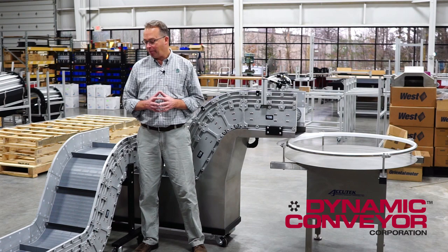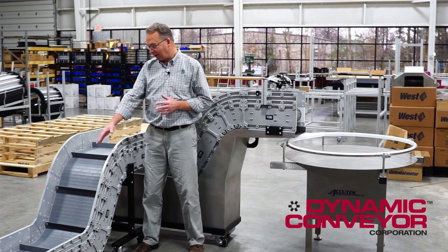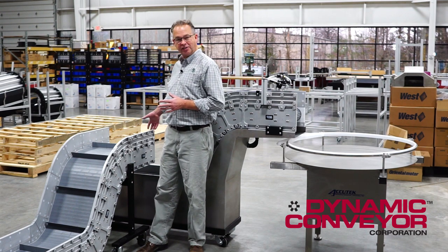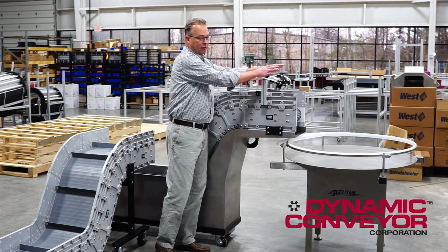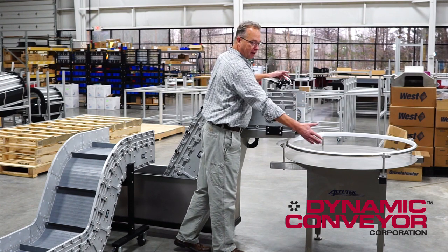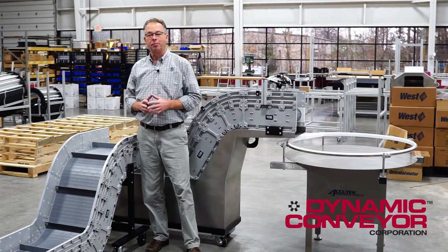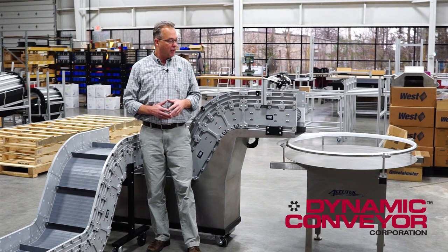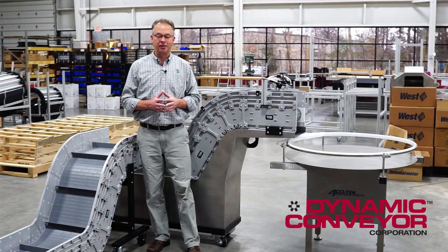This customer was molding very hot parts that were dropping onto the conveyor and we needed to cool them very quickly, so they effectively come up, out, and drop into the water tank. The water tank quenches them, but they need to be packed out over here, so as they were coming up we hit them with the air cannons to dry them, and then they accumulate here while a person packs out on this side and a person packs out on this side. Let's take a look a little closer.